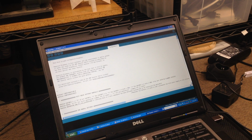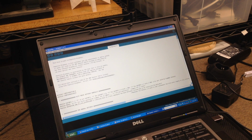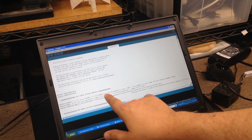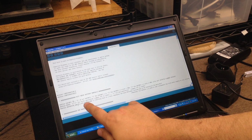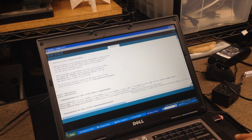Okay, so the next thing we're going to need to do is go to Configuration.h. Now this is kind of standard in the whole Marlin Repetier world. And again, for most C-based programming languages, your config.h file is going to control your settings. So you're going to want to go down here where it says edit these settings manually. And again, it's set for DaVinci 2, and if we look down here, 0 if not DaVinci, 1 for DaVinci 1.0, 2 for DaVinci 2.0 with one fan, 3 for DaVinci, so we're going to set this to be 1, 1 for DaVinci 1.0. And then since we have the newer version, what we'll have to do is go down here to define model, and since we use J37 to reset, we're going to need to set this to be 1. I'm going to move the comment over.